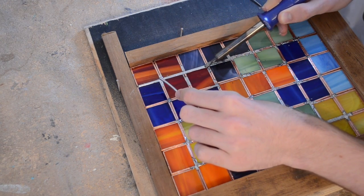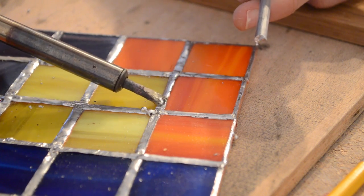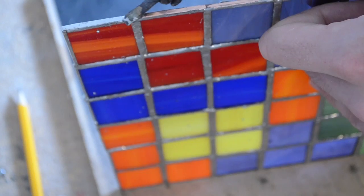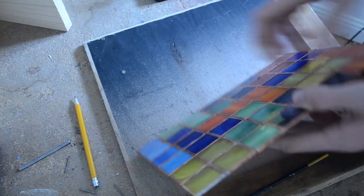This process was just like painting, but with hot metal. When you're done, it should look like a continuous bead of solder that runs around the entire design. I learned the hard way that a soldering iron less powerful than 75 watts will have trouble. When you're done with the face, turn it on its side and do the edges. And when that's done, do the backside.